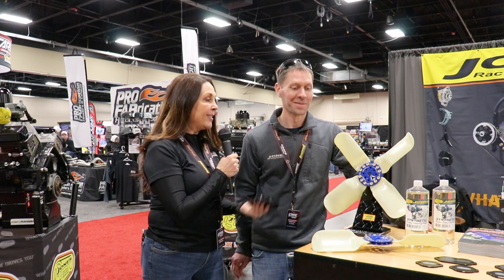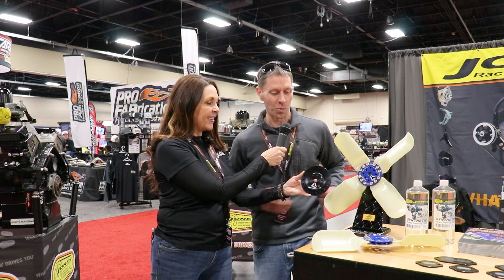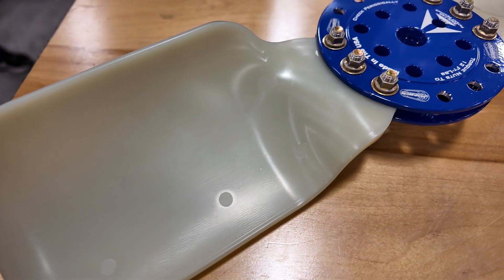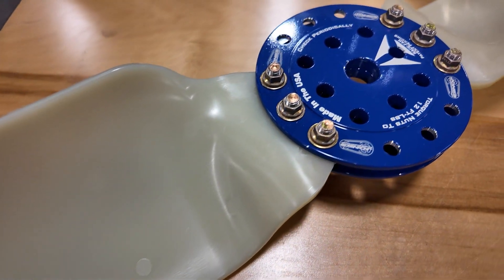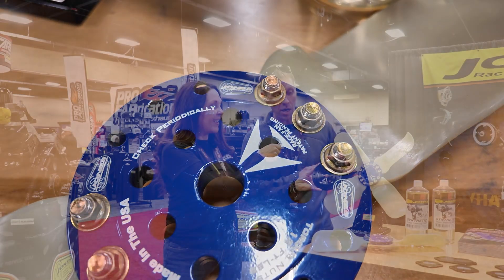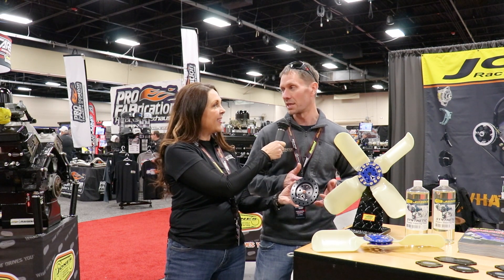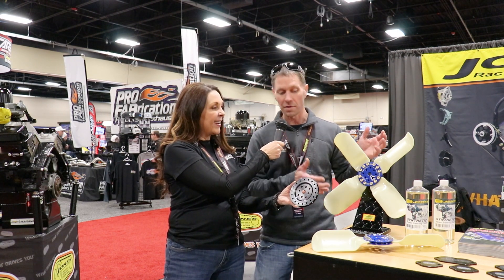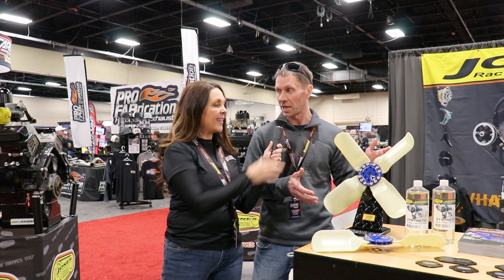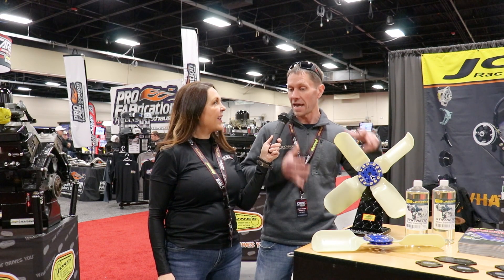I see it's blue. Tell me a little bit about what we're looking at here, CJ. What we've done is worked with Ken to incorporate his normal style fan blades, which we consider to be an odd size — so a 15, 17, or 19 — which all our customers currently have, but then downsize the hub so we can turn them into an even size. We can take those same blades and turn them into a 14, a 16, or an 18. What we have here is an 18-inch fan blade size, but with 19-inch blades on it. In essence, we're still pulling 19 inches of air, but through an 18-inch hole.